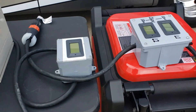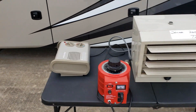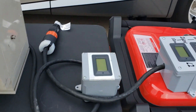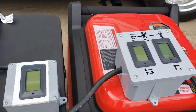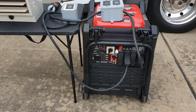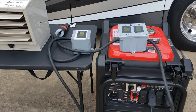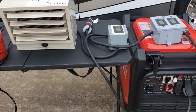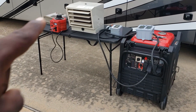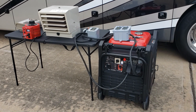Right at 500 watts on the variac it shuts off, and that's exactly at full load for the 9500. We'll do the math on that and put it on screen so we can see exactly where the overload light comes on and exactly where it shuts off. By adding the variac we were able to fine-tune the overload light threshold and the shutoff point.